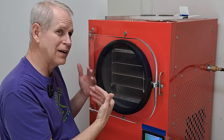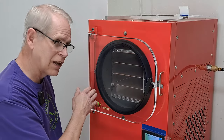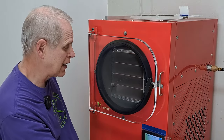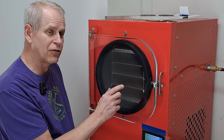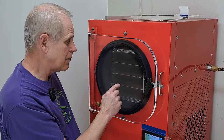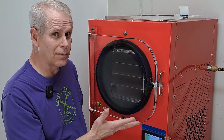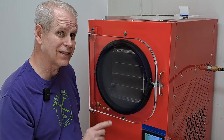The thermometer on the side says a little bit lower than negative 40 — the thermometer only goes to negative 40, so anything beyond that isn't trustworthy. The display temperature is reading negative 55, which is probably pretty accurate because the tray temperature is taken way in the back of the machine. This thermometer is about three-quarters toward the front, and mine freezes from back to front, so it would be warmer in the front. The newer machine like my sister's freezes front to back, which makes more sense since there's more heat loss in front.